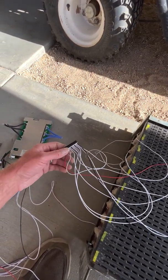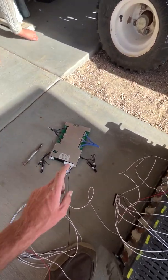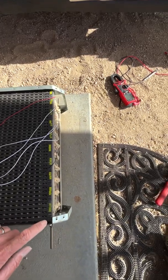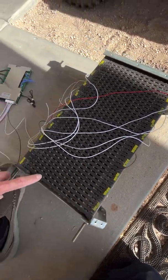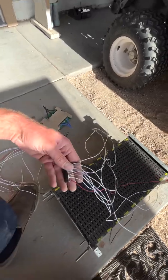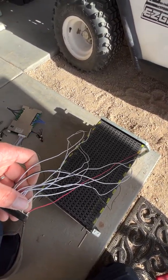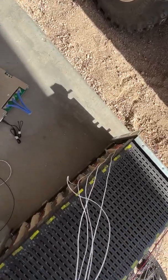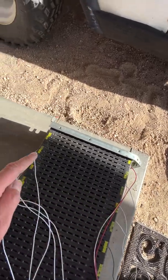When it's plugged in, right next to this one you'll have a black on the far side — that's the main negative and that's the main positive. You're going to hook the lead to the main positive and your main negative. On our cell holders, the yellow is positive and the black is negative. So this would be our main negative lead and this would be our main positive lead. Then we work our way through this systematically, hooking to the main positive and going down the series connections one by one.